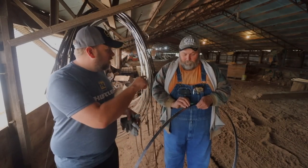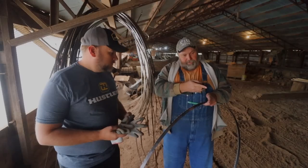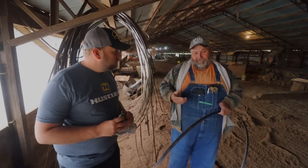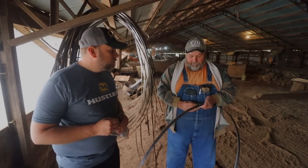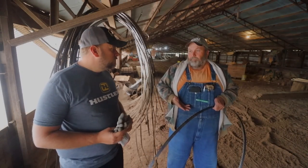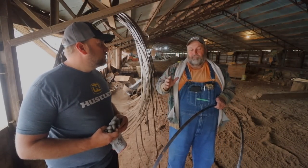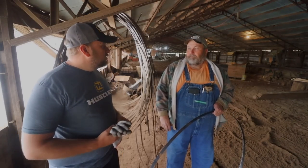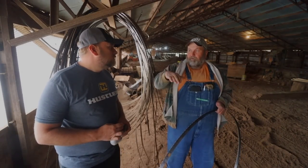Same thing with the chainsaw: the top corner of the chainsaw tooth has to be sharp enough that you can't pull your fingernail across it. I've never used my fingernail on a chainsaw because I could tell after having sharpened it multiple thousands of times probably. But whenever it gets to where it's that way, well, it is some dull. That's not to say it wouldn't cut. It would probably cut on a mill like yours. It's going to be harder to push, and it's going to make less than high performance cuts. It'll follow the path of least resistance as it gets duller, and so you'll ride up over knots or whatever.